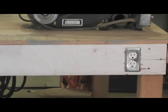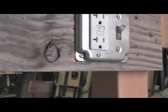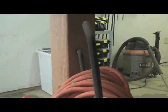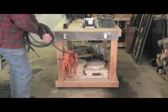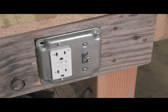On one end of the bench I have regular receptacles, and on the opposite end I have one regular receptacle and one GFI, and the entire bench is controlled by a switch. The bench is powered by a cord that has some length to it and a hook where it can be stored. On the other leg, I've put another hook to store additional cords. All you have to do to power the bench is take the cord off the hook and plug it into the wall. The GFI protects all of the outlets downstream of it, and the switch is an emergency on or off switch for the bench.